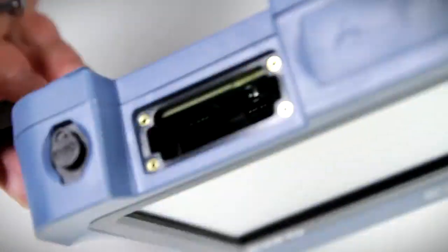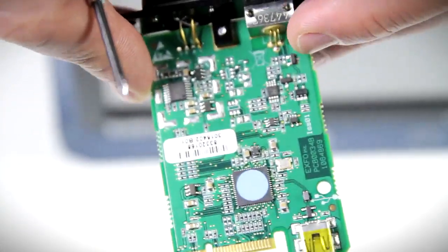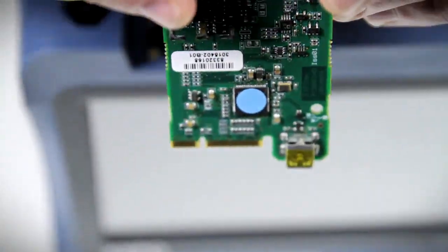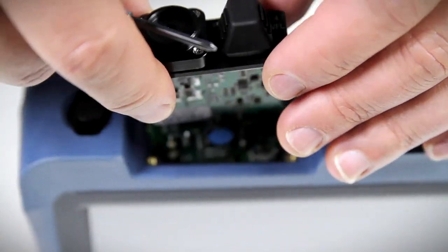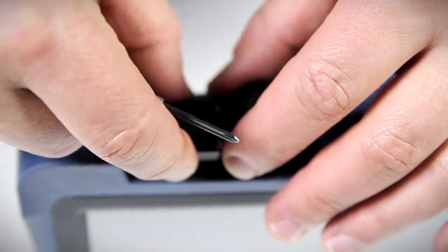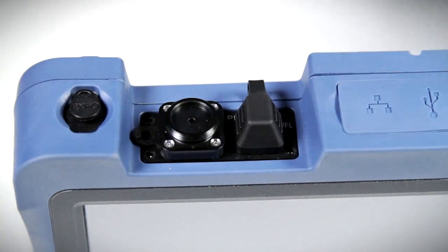Next, insert the optical part, which fits into place very smoothly, and then replace and tighten the bolts. This procedure is for the MAX FIP, but because the same plug-and-play optical options are also offered on the MAX 700B OTDR series, the same fast and easy self-installation steps apply.